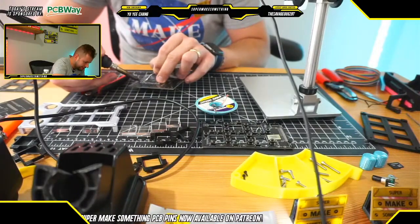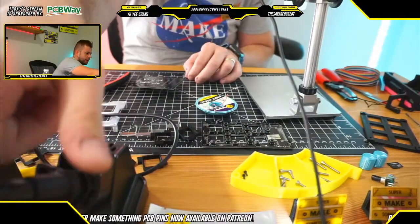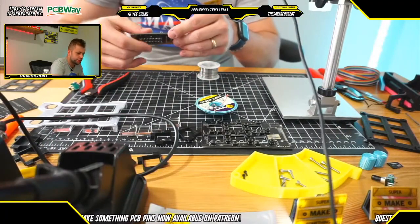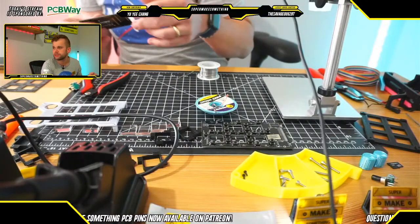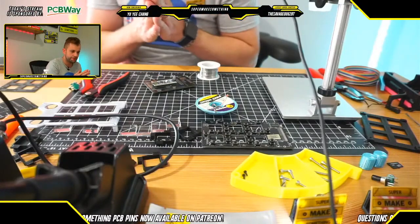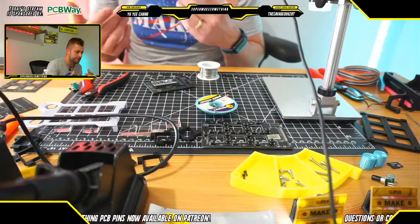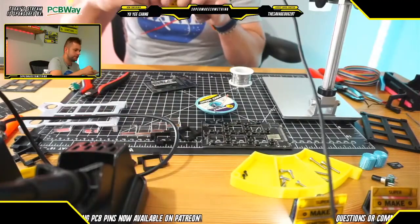So basically, the only kind of touch screens that were available were resistive touch screens that are available for some hobby applications. And those are pretty good for what they do. But my concern there was that the lifetime of the resistive touchscreen might not be high enough, and the screen could get damaged. For example, if you're on stream and you're pushing buttons very hard.